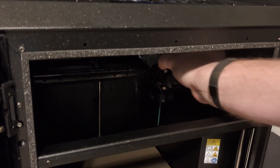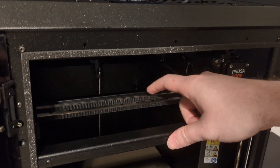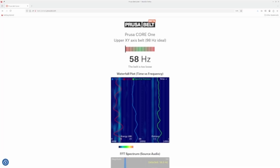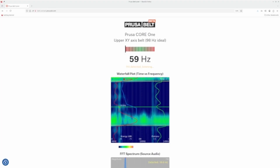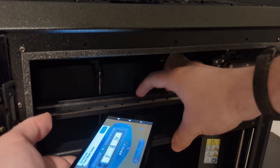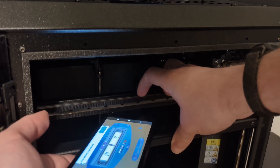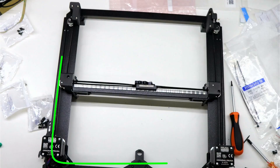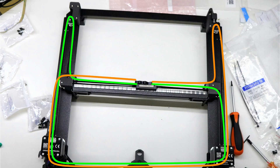One of the last steps is to correctly tension the belts, which is measured by the frequency of the belts when you pluck them like a guitar string. Prusa provides an app and a website for measuring the sound frequency, but I found these tools to be unresponsive. I found a different app in the Google Play Store that did the trick — a link is in the description. One thing neither the manual nor the Prusa apps mentioned is that with a Core XY design, since the belts are tied to the same carriage, if you change the tension on one belt it affects the other as well. To tension them correctly, you have to keep going back and forth.